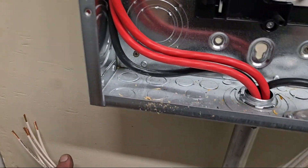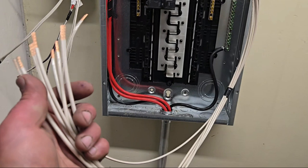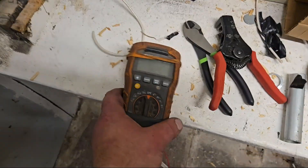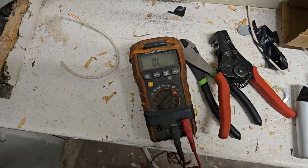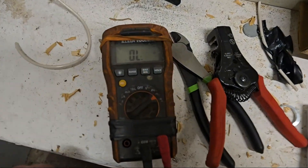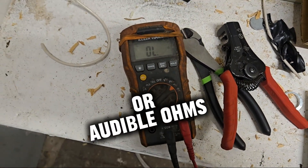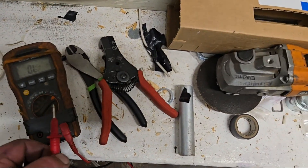Here's my cluster of wires on the other end — they're all stripped coming out the conduit. And I've got my trusty multimeter. Now what I'm going to do is put it on audible continuity — that setting there that looks like waves. Touch these leads together.